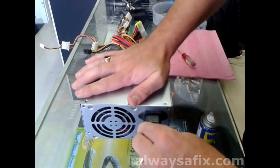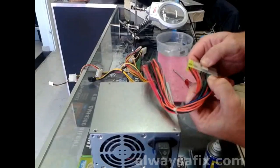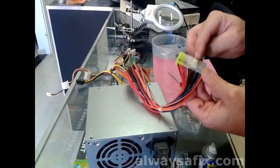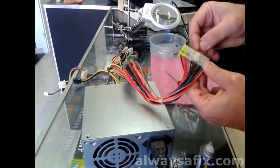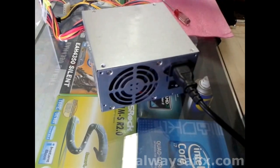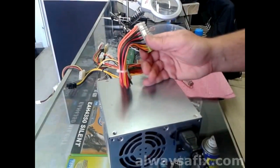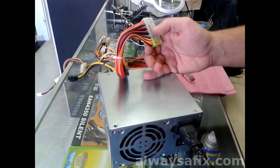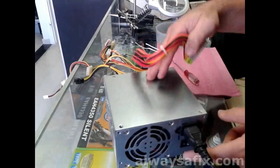Let's give it some mains — I'll plug it in. On your connector here you'll find only one green wire. If we bridge the green wire with the black — the black towards the inside of the connector — that is the same as power on from a PC. When you do that, your fan should start to turn. As you can see, this fan is turning. We'll mount this inside a PC and give it a test run, but it looks like replacing those capacitors has ended up being a fix, and we do not need to replace this power supply. Thanks for watching — remember, there's always a fix.